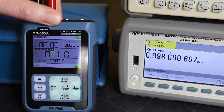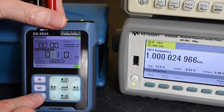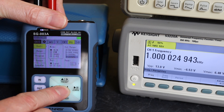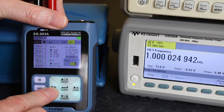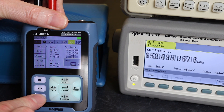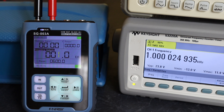Turning it back on at 12 volts, we're actually reading 13 volts peak to peak on that one. Taking it all the way up to the maximum 24 volts — we've turned off again, so go back, turn it on — and we get 23.8 volts, so not quite there but close enough really.